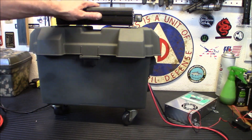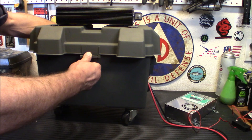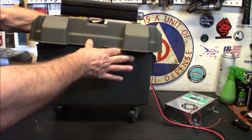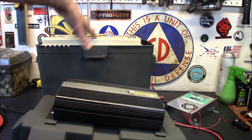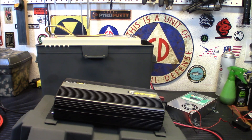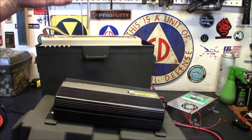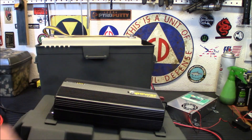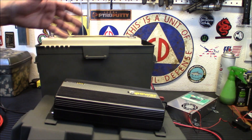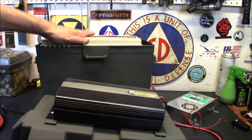The brackets worked perfectly and the charge controller is on there good. Now we're going to run the wire coming out of the side into the plus and minus — that'll be off our solar panel — then run those wires back inside. If I had a bigger box I could have mounted everything inside. But I realized I don't even need a separate meter because the charge controller display will tell me the state of the battery at all times.